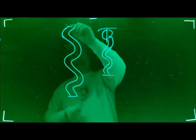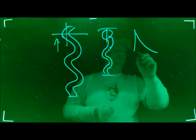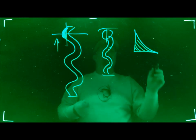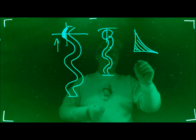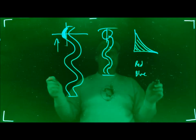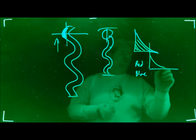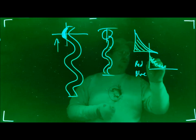So what I found here is if we were to take a cross section through this point right here, looking this direction, here's our sidewall. We would see this buildup of material in this eddy. And what we noticed every time with the material is it was stratified. It was candy caned or layered. We would run material with glitter in it. We'd run a hand scoopful of material with red glitter, and then a scoop with blue glitter, watching the layers and trying to figure out what's going on, because we were doing all sorts of cool tests. We're trying to figure out what the secrets are with these boxes. And what we felt was happening in the stream is the material came in right away, got deposited, and then the eddy would eat away at it and process this material right on the top surface.